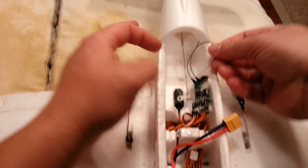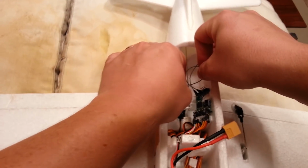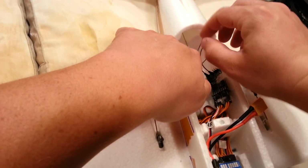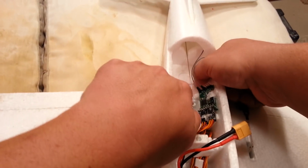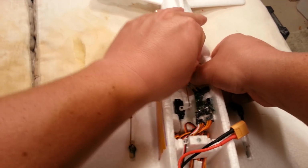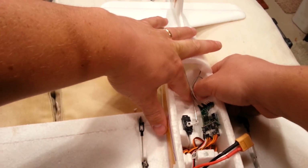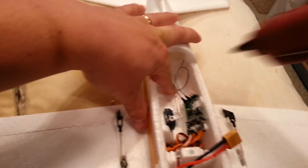Now this one I want to do the other direction, like this, laterally. So I'm going to go ahead and slip this in here and find a spot where it's going to make sense and still look nice, but be as far to the tail end as possible. Like that. Okay. So you remember, you don't want to stress this where it comes out of the sheath, the exterior sheath on the cable, because that's going to be the weakest point. Because ultimately, somebody stripped that wire there. So there's a good chance you'll have a little bit of mar into the finish, even if it's very carefully done. But I can tell you for the price of this device, it probably wasn't very carefully done.